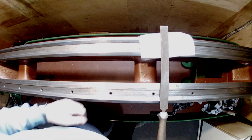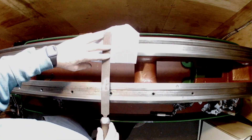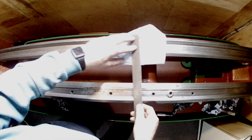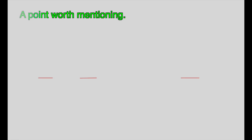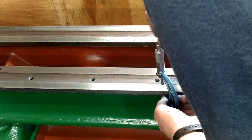However, I had to make sure that the other end of the file didn't damage the tops of the V-slides. For this I initially used a bit of tissue paper on top of a plastic bag, but after the bag flipped out a few times I ended up with just a bit of folded tissue. The tissue held the file as flat as it could possibly be, but not without an error. When I pre-finished with a finer file using the same method, I could use one layer of tissue folded only once. After using the fine file, the rough high spots disappeared, leaving me with about a thou to remove for the finished size.